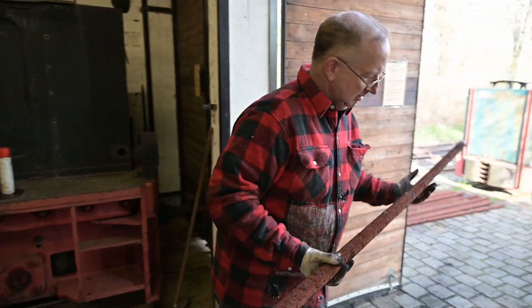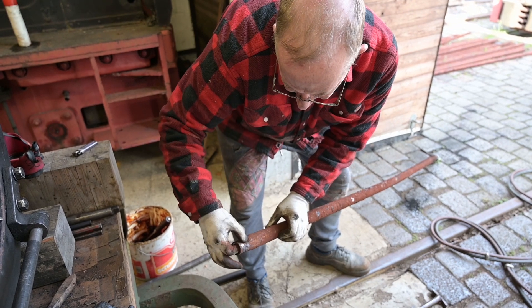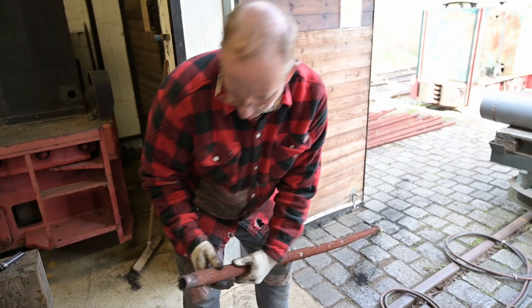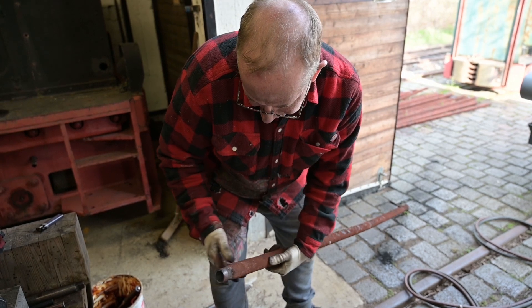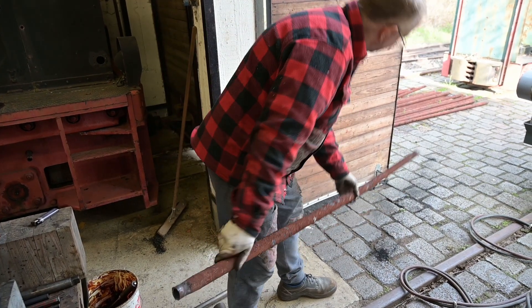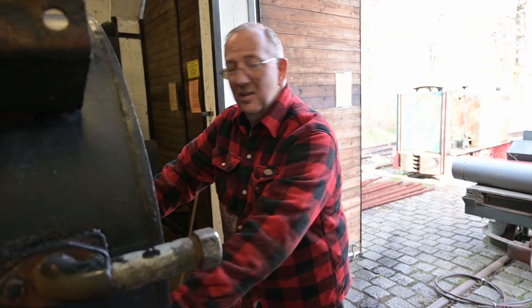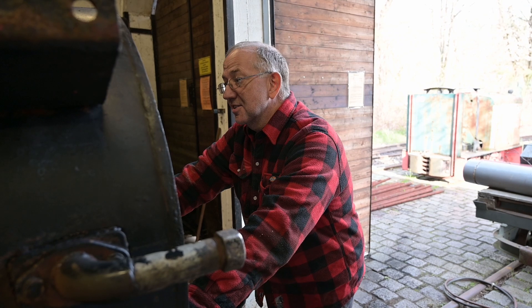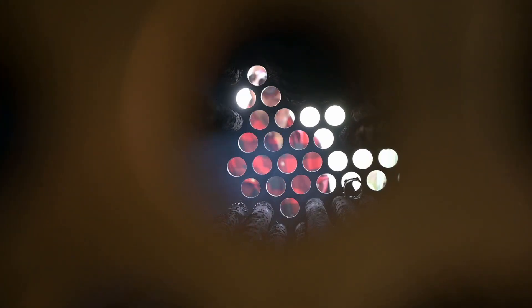And we have another tube. It's a very thin feeling there — it's almost eaten away half its thickness. Now we just have the little problem of the stub of tube that's still left inside and we knock that through into the boiler. So as before, I cut the tube. The tube is too big on the end so I've got to warm up the end so it comes in on itself and becomes smaller.